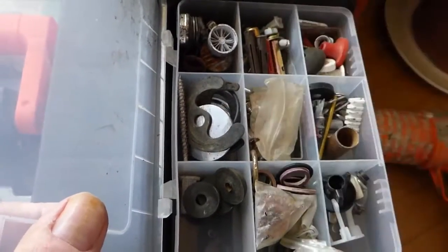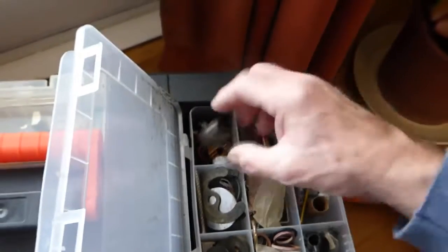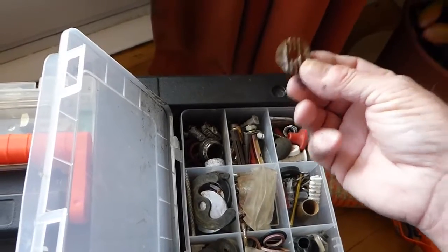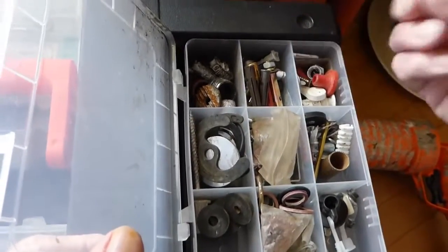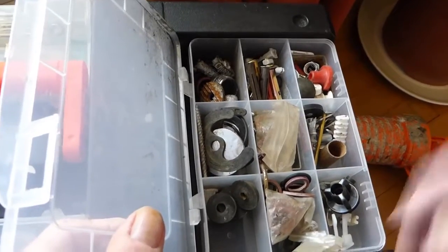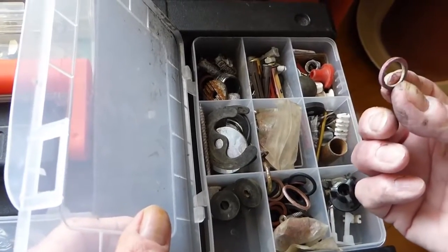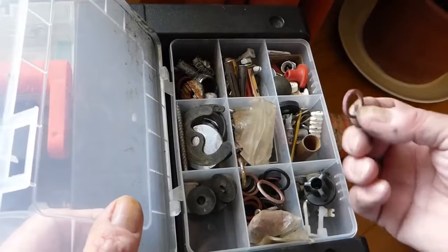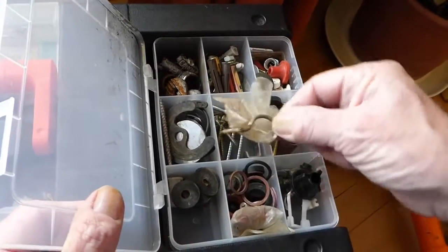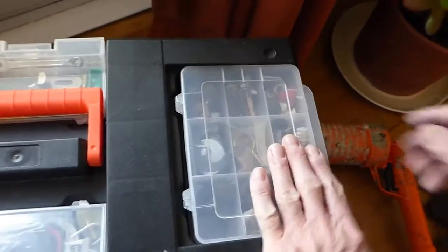Generally I carry a separate box for screws. Just general bits and pieces that can be very handy — there's even a rad blanking valve there, and what's that you might say? That's a three-quarter or bath tap resetter, just general bits and pieces, and even a seat bolt there for doing a plastic toilet seat. Just general items you pick up over the years. That is a straight swivel washer, goes on the end of a tap — so if you've got a tap and the washer's gone and it's leaking on the pipework underneath, if you can drop one of those on, that will seal that up.